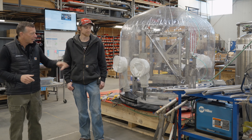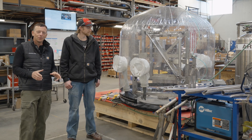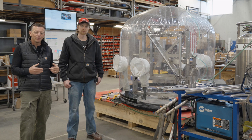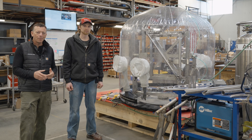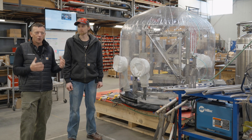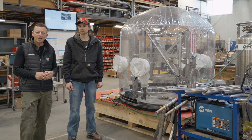So behind Gabriel here, you'll see the bubble. One of the first things you have to do when you're approving something like a titanium gear for a cub is you have to prove out that you can actually weld titanium in a repeatable, safe, proper fashion. And that was a big part of this — making sure that our whole process was repeatable and verifiable by the FAA.